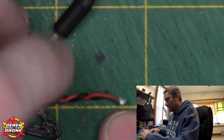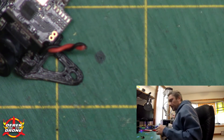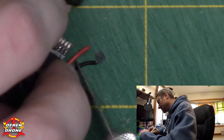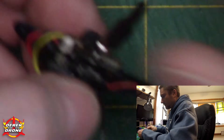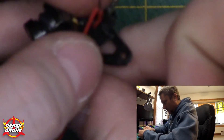We're done with this repair. Now we need to extend these wires because they are not going to reach the power connector when we do our build. I'm actually going to start by removing about half of the wire here. I'm going to untwist these guys. Now we're going to strip these wires — I like to strip silicone wires with an exacto knife. It makes it pretty easy; just roll the insulation of that wire around the blade of the exacto knife and as you can see it comes off pretty easily.